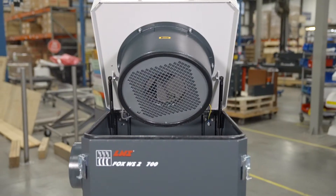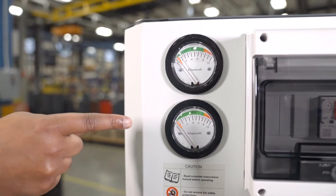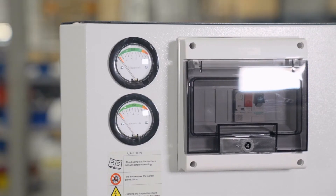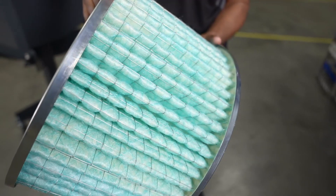The WS2 series are ideal for applications that use emulsion or oil. To maximize each filter's life, the WS2 is designed with two air pressure gauges to provide ease of maintenance. The bottom gauge measures the pressure drop at the pre-filter, and the top gauge measures the pressure drop at the final filter. The gauges clearly show each filter's clogging or pressure difference, making it simple to determine when to replace each filter. The proprietary filter's average lifespan is 4,000 hours of mist collector operation, depending on specific processes and applications.